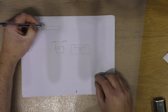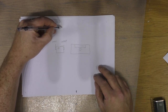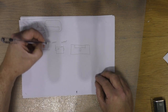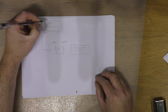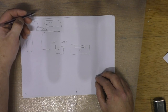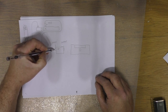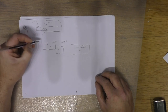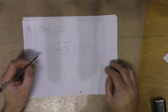The output on the DBX is a quarter inch, so we come over to the DI box. Here's where we start to get a little bit complex. This plug will be a TRS — tip, ring, and sleeve — meaning that it is balanced coming out. When it plugs into the DI box, this will be a TS plug — tip and sleeve. There are two ways you can do this; both of them work, I've tried both.